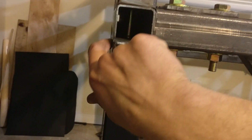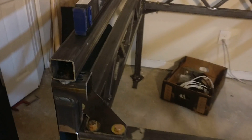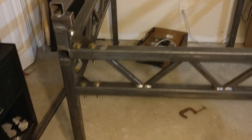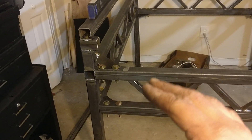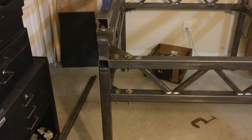I think the next step will be to tack these standoffs in place. I'll come in with a piece of flat bar on this side and this side and clamp it down with a bit of a standoff to get past the weld beads here, and just tack it so that these standoffs will be as much in line with these legs as possible. Then I'll remove the trusses, weld all the way around the standoffs, and grind this flush so the truss can come back in place. And when I reinstall the whole thing, I will shim the feet before I do the bolts, and that will hopefully get these tops much more coplanar so there's less adjustment to do at the top of the standoffs. That's the theory anyway — and if not, fuck it, I'll just use the shims.